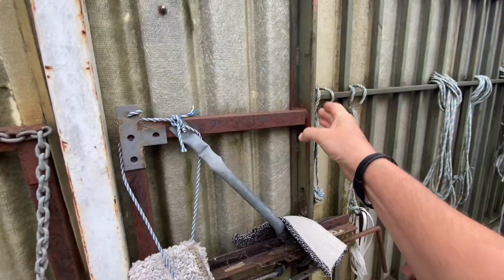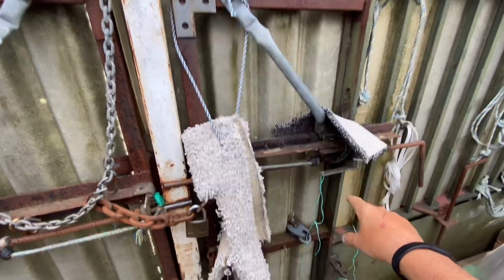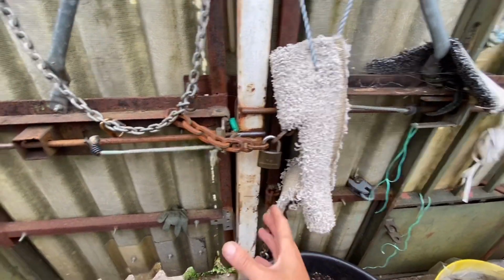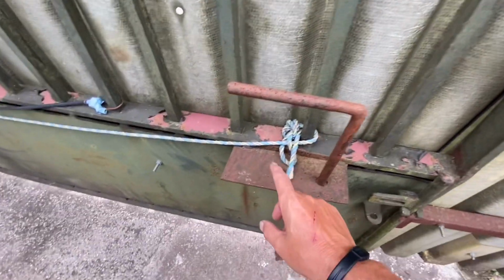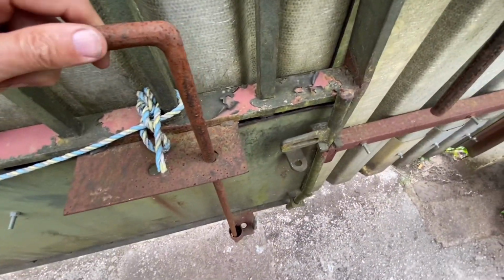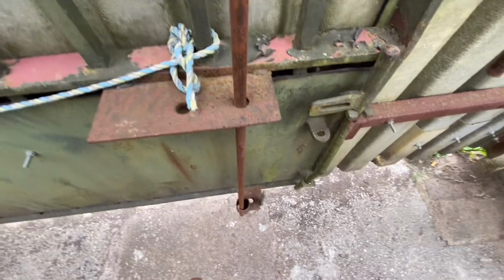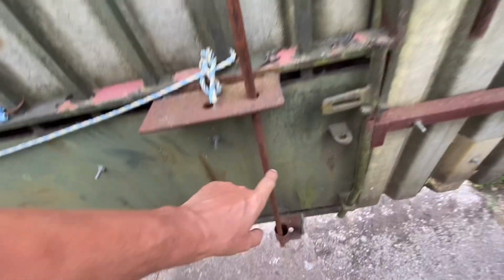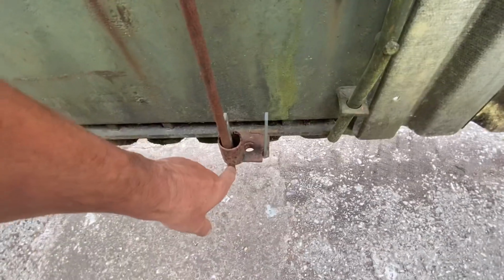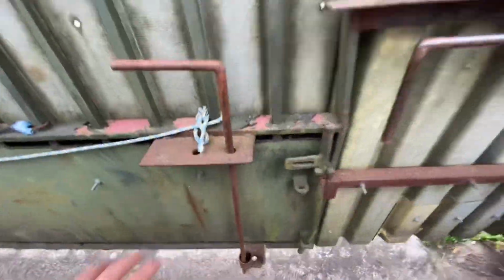Again, look, there's the original gate. Just extend a bit on, weld a bit on, stick it, electrically glue it. It's basically all that it is really. Again, I needed at that time a pin that goes down through the door, through the floor. So angle iron with a hole, got the bar, made myself a little keep there at the bottom, using what I've got.